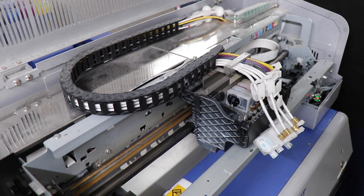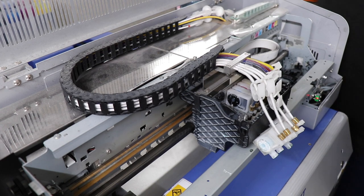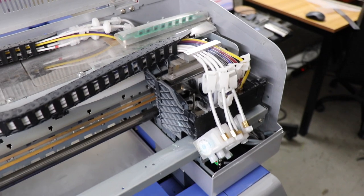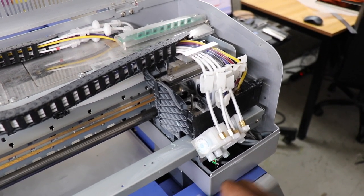And then you're going to pump up your solution, your wet cap solution, in the printer, or in the wet cap station, I'm sorry. I just want to make sure it's a little bit clean before I start suctioning ink through there. Okay, good. One more. That's good enough. Okay, so dock your print head. Now that you flooded your lines, it's going to leak a little bit. That's okay, don't be afraid of a little leakage.